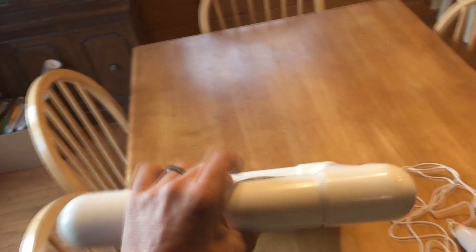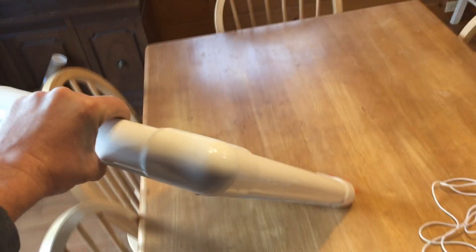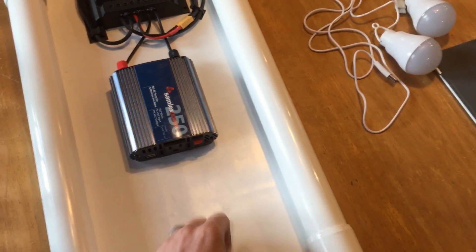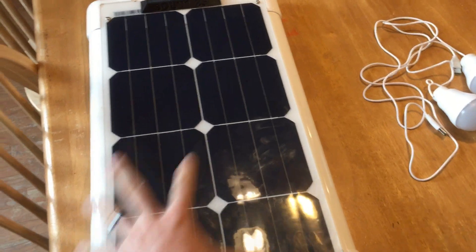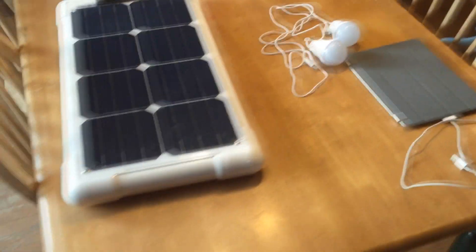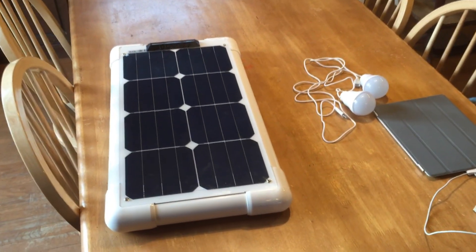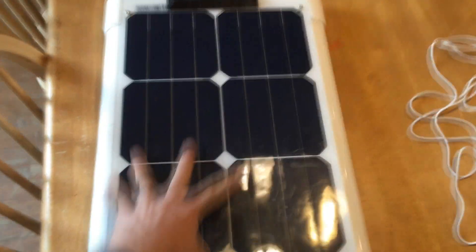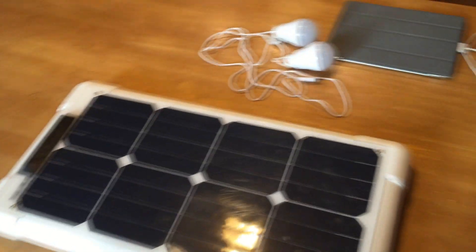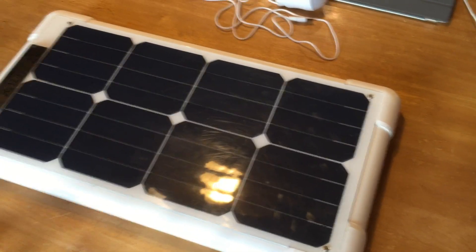These are very amazing batteries — spec'd at 780 watts continuous load in this arrangement with a peak of over 2,000 watts out, and rated at 2,000 charge-discharge cycles with still around 80% life remaining. Everything is inset below the frame, so nothing's sticking out. You can add a small extension cord or power strip underneath, out of the sunshine and dew. Check out the clips at the end of this video on the different loads this thing can drive, and follow along as I bring these into production.